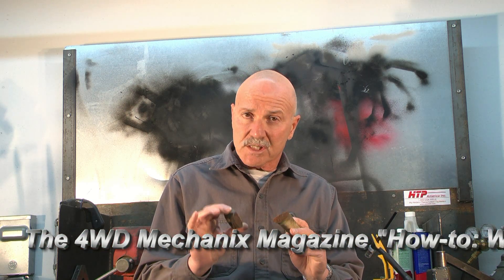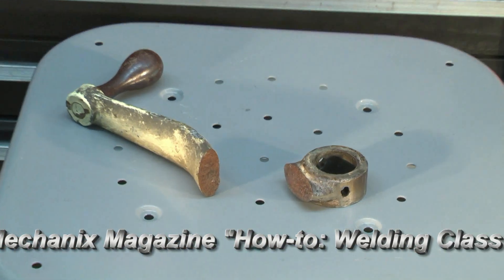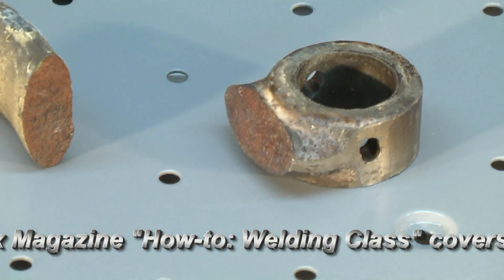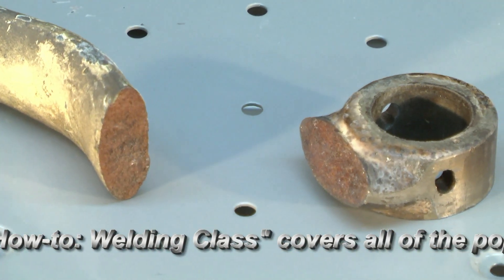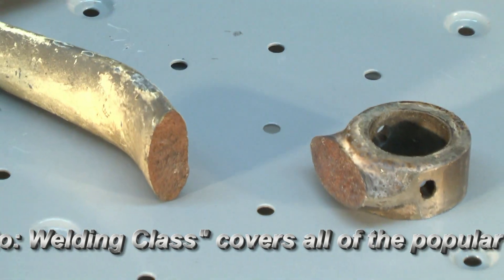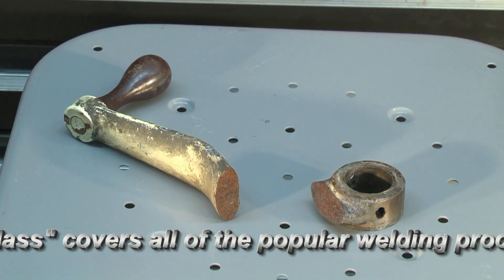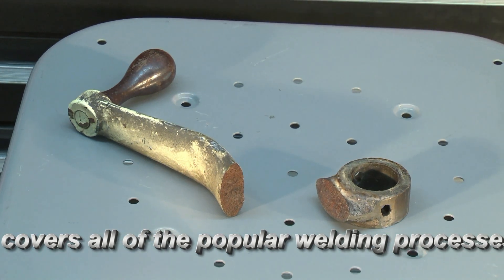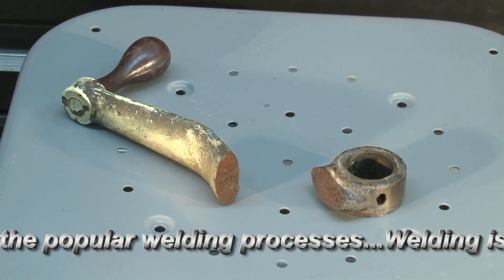In identifying the material, I did some research. From original blueprints and instructions that came with the lathe, this material is called semi-steel. Metallurgically, semi-steel is interesting stuff. Looking at the ends of the break, it struck me as very similar to cast iron. Semi-steel is actually made of cast or pig iron combined with scrap metals to lower the carbon level to the point that it behaves a lot like cast steel.